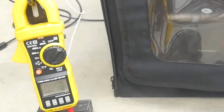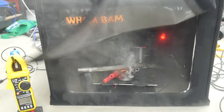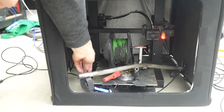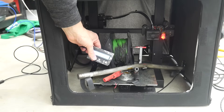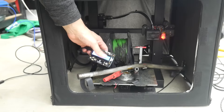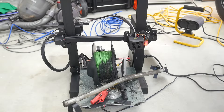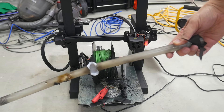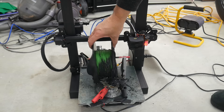We can see that the enclosure temperature lost about 30°C within the first few seconds and continued to nosedive after that. Inspecting the aftermath, the 3D printer was still running with seemingly no damage to the electronics, and the little Arduino module was still functioning exactly as before. Furthermore, there was no residue — that's a definite tick for the claim that electronics won't be damaged by the gas. Removing the enclosure, we can see the extent of the damage within, and the T-Series had fallen off the roof from the shock — I don't think this would happen if installed more securely. This is a one-time use product, and we can see a giant rupture where the gas escaped and put out the flames. So yes, this would now be going in the bin, but hopefully it would have done its job and stopped a much larger catastrophe.